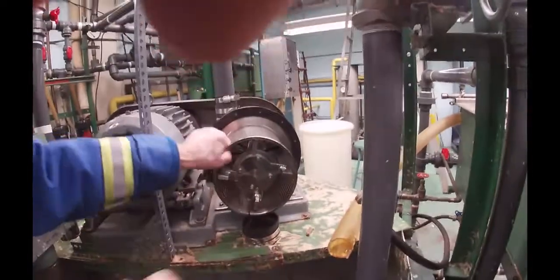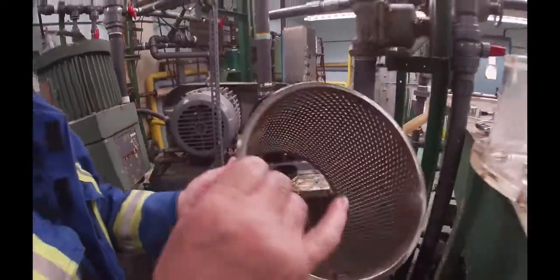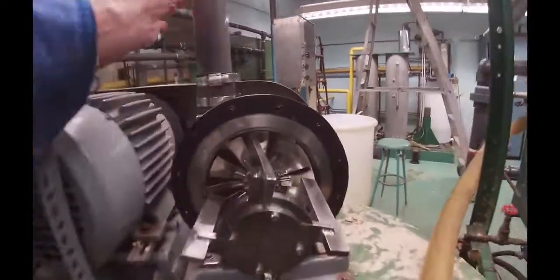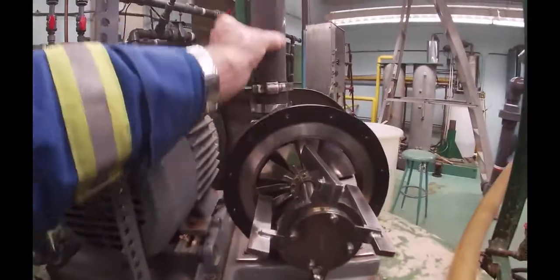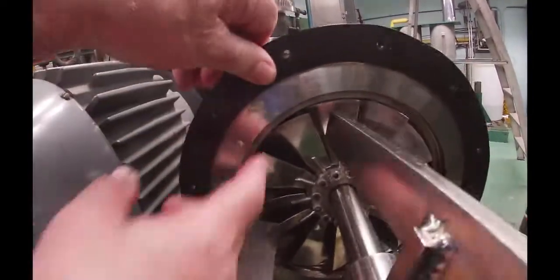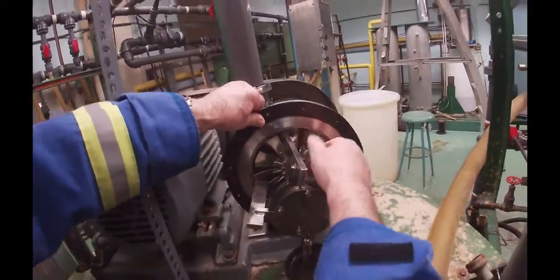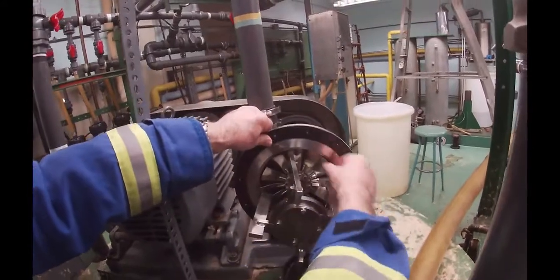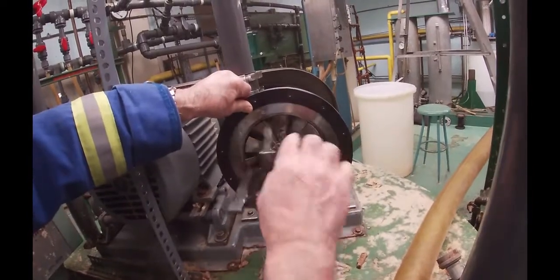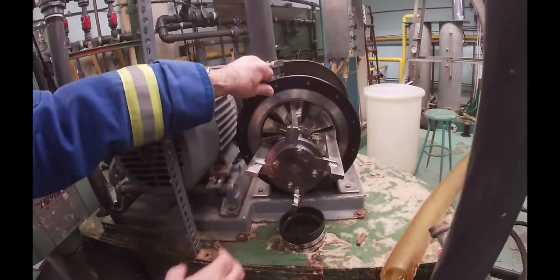This is the screen and I'm going to remove it now. So now you can see the size of the holes in there. The stock that was coming in comes down through this line and right about in here it goes into this back section. Then the stock actually comes out through these little openings here. Remember that the sleeve is all the way around there, so the stock is coming into this center area. These blades are going to spin and push the stock out through the holes. The rejects are going to be stuck in the middle here.